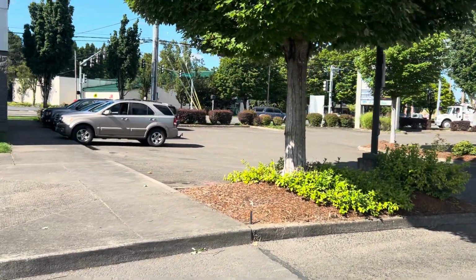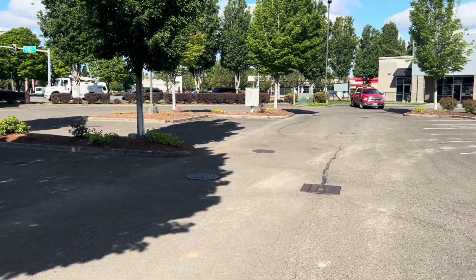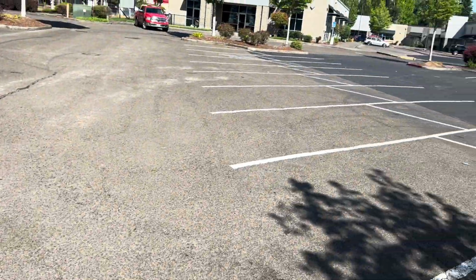So we're doing this whole lot here. No crack fill on this job. And the reason why we're not warranting it is you can see how porous and beat up the asphalt is. So we're definitely not going to use the buggy on this guy.